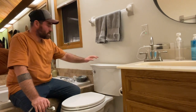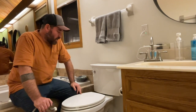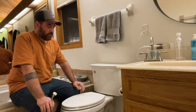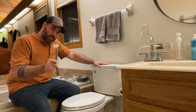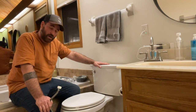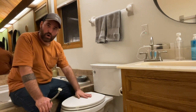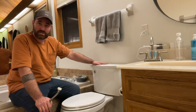All right guys, so that is it. The biggest thing when installing a toilet: one, make sure you have all the tools and everything readily available. One of the things that came up for me is that I did not anticipate that our feed line or water supply was going to be too short. And if you're increasing from a standard toilet to a chair height toilet like what we've done, make sure that you pick up another supply line — something a little bit longer. I ended up picking up a 16-inch and it works out perfectly. If you have any questions or comments, please leave them in the comment section below. I'll give you an update later on about how our no-wax seal is doing. So far everything seems to be working out great. That is it for today, guys — thanks for watching and we'll see you soon.